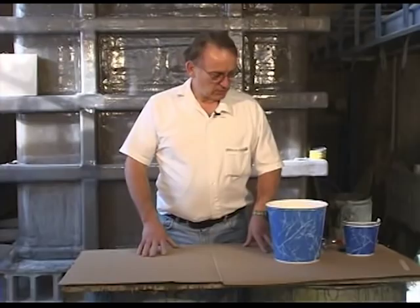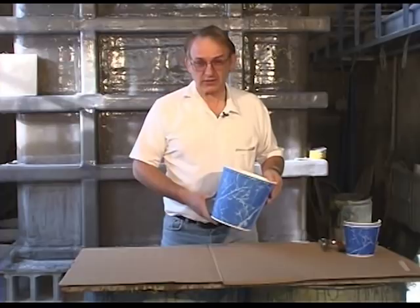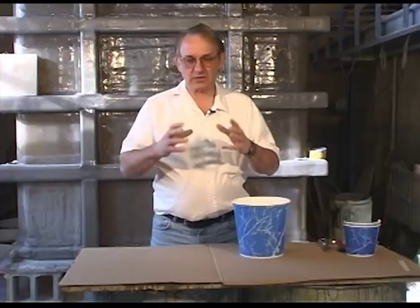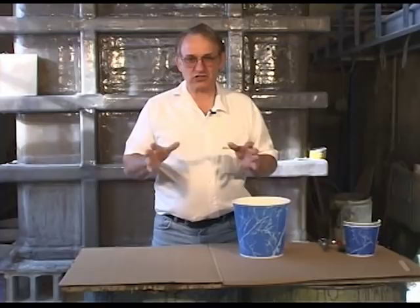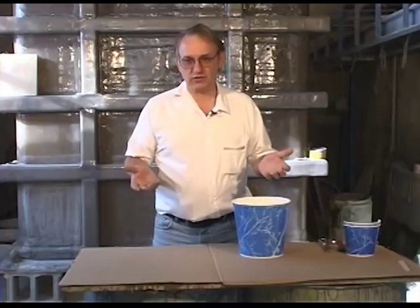Well, as we move along with the tools of the trade in fiberglass here, one of the things you really have to think about is the bucket you're going to put your resin in. Now, you probably think, well, I've got an oil can around here or a margarine tub I can use. Let me tell you, in almost 40 years of experience, nothing's worse than to see somebody come in and they've got a bubble, some contamination that's gotten into the laminate. I can't stress it enough that cleanliness is godliness in laying up fiberglass. Contamination can ruin a product or put a void into it, and it means a costly repair for you, which is time consuming, especially if it's in gel coat, because now you've got to try and blend a color in again, and get the shine and the sheen back.